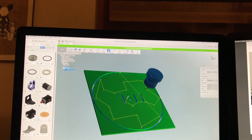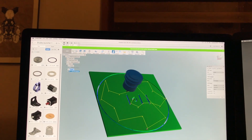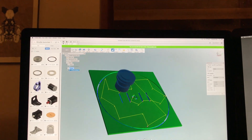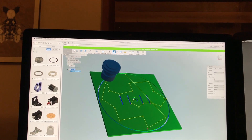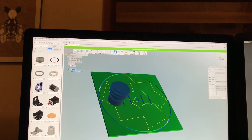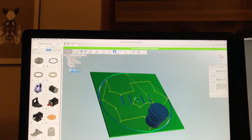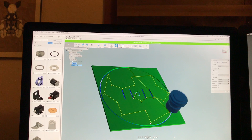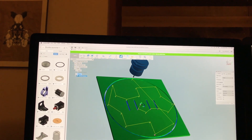I'm a little concerned that if my machine isn't exactly level or square, it might not cut all the way through. So I might have to do a couple of tries, or adjust my file so that it cuts deeper than the quarter-inch MDF and use a sacrificial piece underneath that can just get trashed.